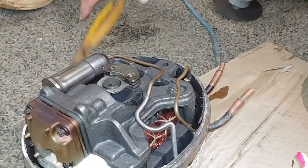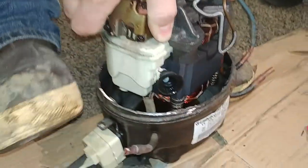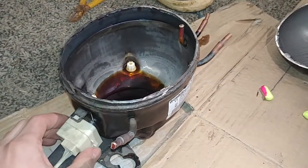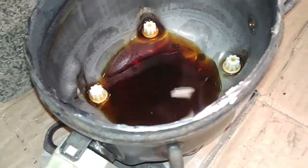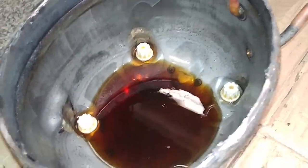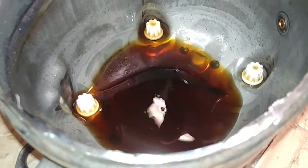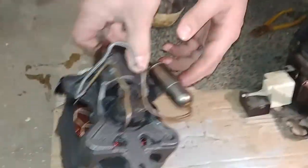Let's clip that line off — oh, it's still pressurized. We have electrical connections that must go in through here somewhere. Pulling off the wires — wow, that was easy. So there we have it. Why is it bubbling in there? The reason it's bubbling is it's rejecting refrigerant that is trapped inside the oil — kind of like when you have a soda and the carbon dioxide is suspended in the liquid.